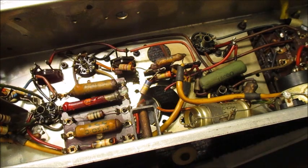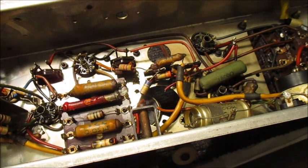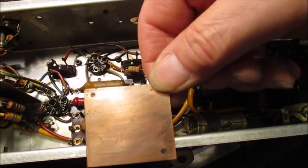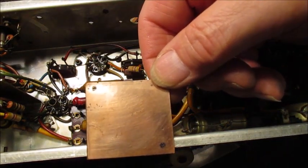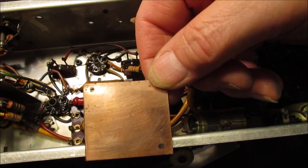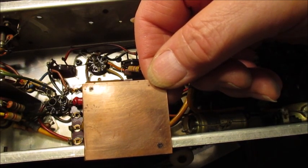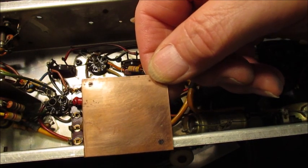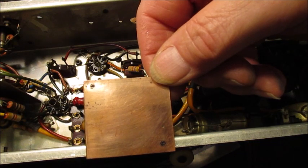I'll let that canister drop and now I will measure for the holes to be cut in the circuit board. I've marked where the two securing holes are to be located, and now I'll centre punch this board and drill the holes so they accommodate 4BA screws.